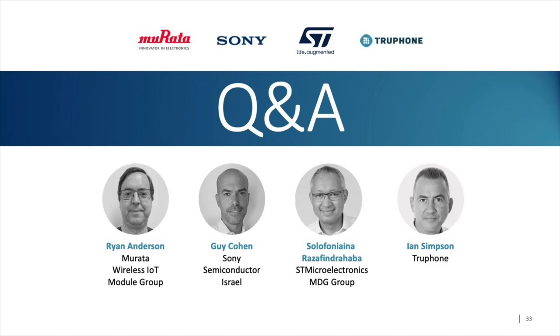Thank you for this question. So also here, it much depends on the exact use case. I would say that the main point to consider is the extent of the device reachability. The PSM is more suitable to applications which can go to a long sleep period and without a need to listen or communicate with the network. In such devices, PSM is a great fit to allow a minimal power consumption. In case the device wake-up frequency is small, power consumption will increase, and at some point, eDRX may show better numbers. Again, eDRX is suitable to devices which have a need to respond to the network faster. Combination of the two modes during device lifetime is usually also a good choice to meet the application needs and optimize power consumption.